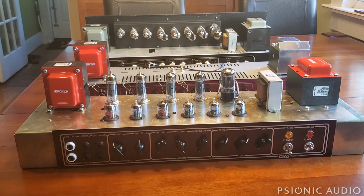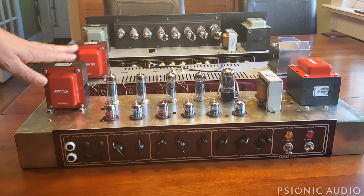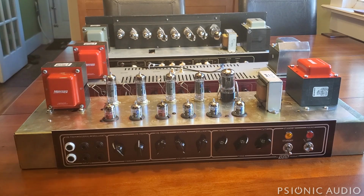Now I work on originals as well. I don't just work on copies or the modern ones. And when I get an original in, I measure everything that's in it. And the old resistors drift a lot. And sometimes it doesn't sound very good. And sometimes it sounds awesome. Sometimes you'll say, wow, that value that resistor ended up at really makes this amp sound fantastic for a particular playing style. So I've got a notebook of all the things I've noted in old JMIs.